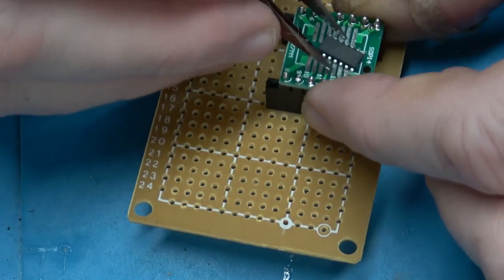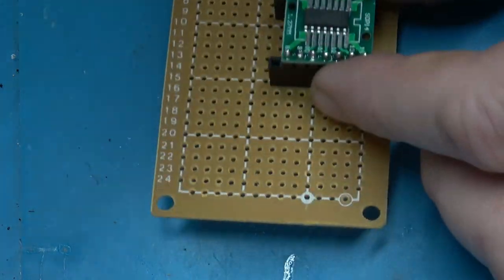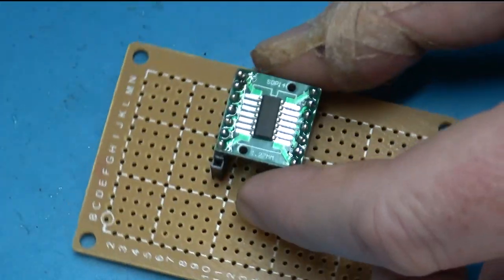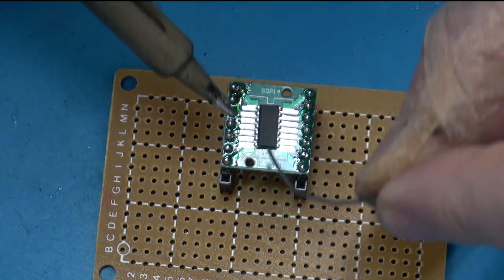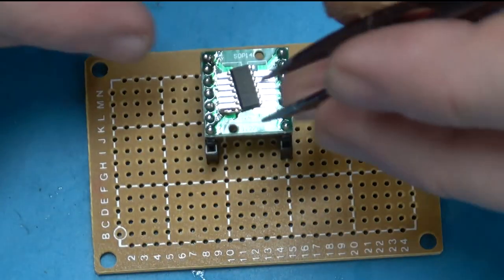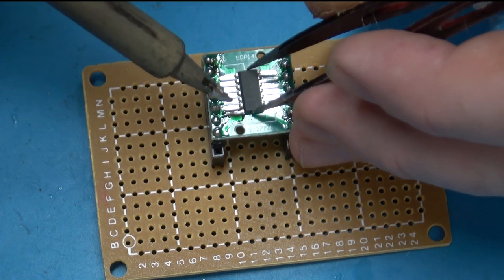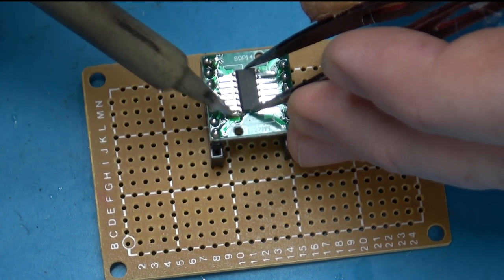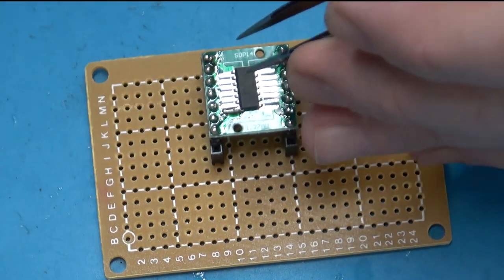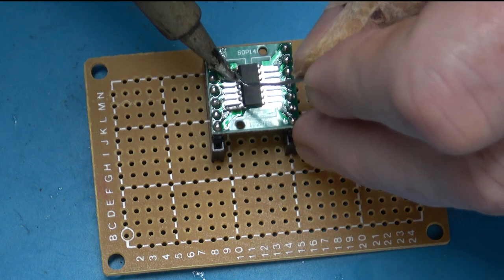Got a bunch of these laying around. And also, my motivation for doing this is I'm also using this chip in another project that I am slowly making a video for, using parts from one of those cheap Menards watches I found, basically to make my own watch, because this chip has a real-time counter on it. If you combine that with an external watch crystal, which is 32,768 hertz, you can basically make an RTC without needing an RTC.